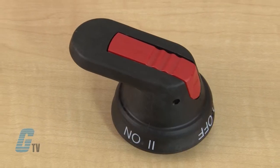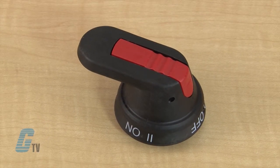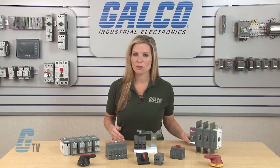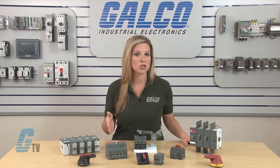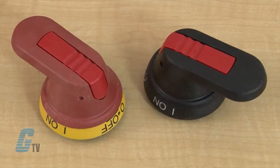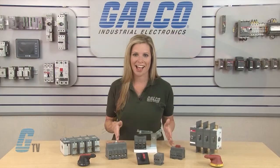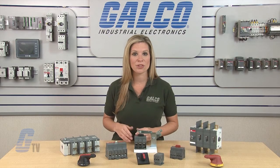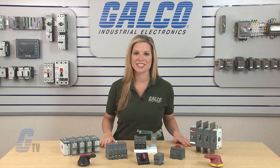The pistol handles are installable by fastening the mounting hardware to brass inserts in the back of the handle. They are available in a variety of lengths from 65 millimeters to 330 millimeters for 6 and 12 millimeter shaft diameters. Black and red as well as red and yellow versions are available in plastic. 316L stainless steel versions are also available for use with non-fusible and fusible disconnects.